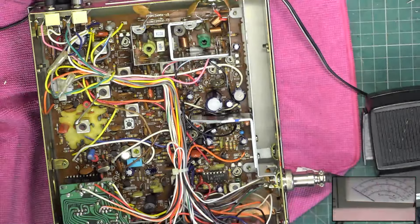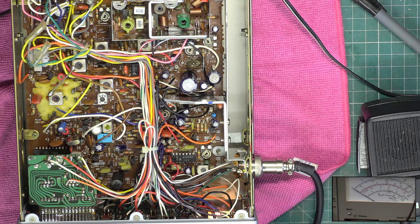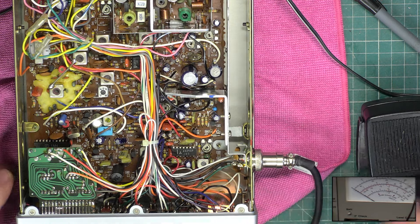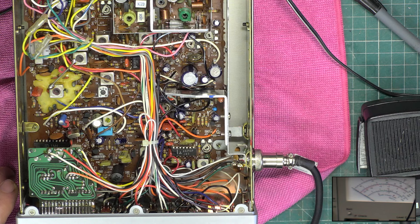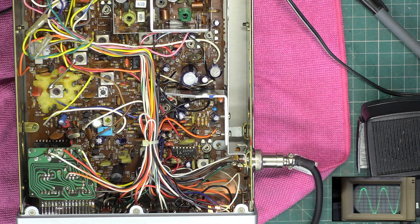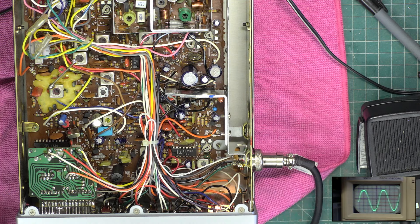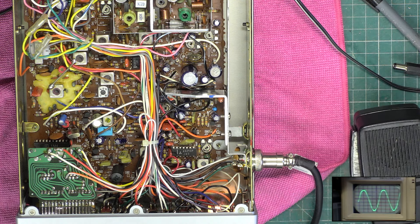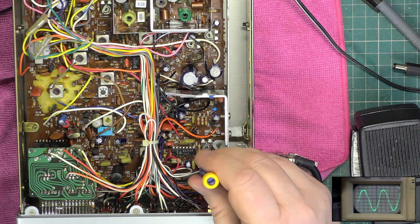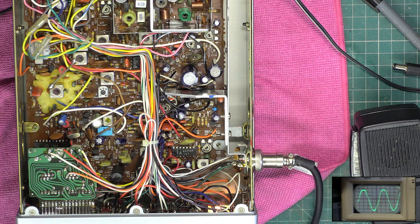Right, let's do the receiver. It was already pretty splendid but we've seen better — that doesn't mean there's anything wrong because it already exceeds the manufacturer's specification. First thing we're going to do, we'll go over to the oscilloscope. I've got 100 microvolts on the signal generator, which is turning up volume for a decent trace on the oscilloscope. That oscilloscope is just connected across the speaker. 1 kHz tone, 100 microvolts — let's see whether we've got peak or not. Hard to tell — if it's not peak one way it'll be quiet; if it's not peak the other way it's garbled.